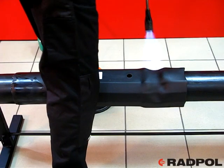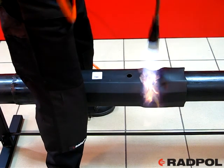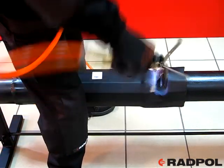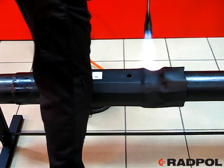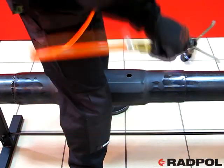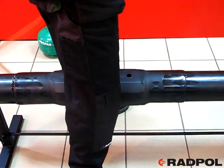Repeat the steps with the other end of the joint. During the shrinking, do not heat the foaming holes and do not overheat the jacket pipe. The shrinking process may be considered finished when the shrunk ends are round and stick closely all around to the jacket pipe.